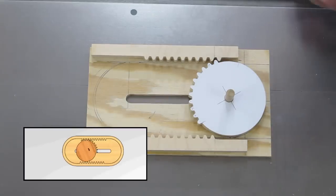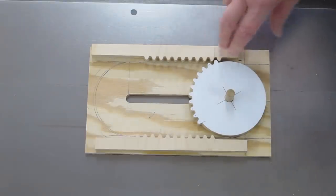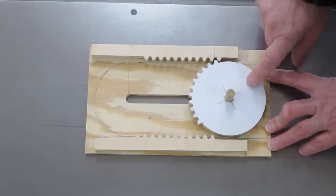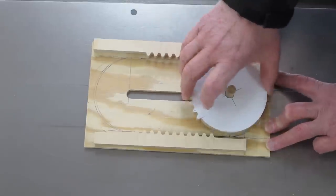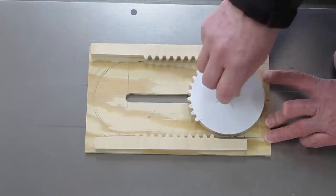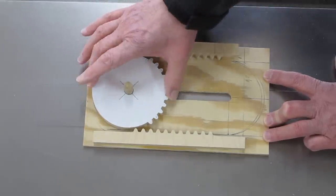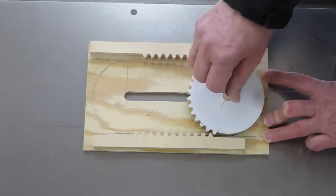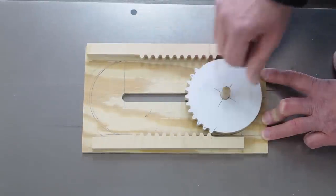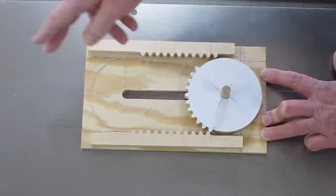I have found animations on the internet of oscillating mechanisms like this. I have not seen any designs for one, so in order to build one you have to do a little prototyping. The way this works is this is driven by a motor on the other side of this plate. The slot limits the travel of the wheel. The tooth engages the rack over here and travels the length of the slot. This tooth will just barely clear, allowing this to turn. It will return to here, the tooth again clears and engages, and it just does that over and over. This is a mechanism for converting rotary motion to linear oscillating motion.